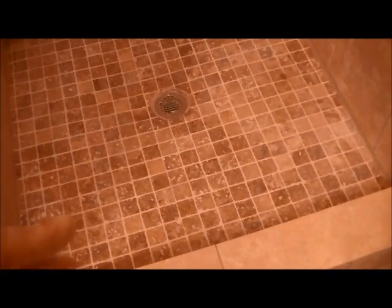This ceramic looks like travertine — that's what the surface is — but it's not. The customer chose real travertine, which is a good choice, and we took it all the way to the ceiling. We didn't do anything with the shower fixture; I put the old trim kit back and he got a new shower head. The only real plumbing I did was change out the drain. I always change out the P-trap, and of course I centered it since this is a whole new footprint — it's a 4x4 shower now.